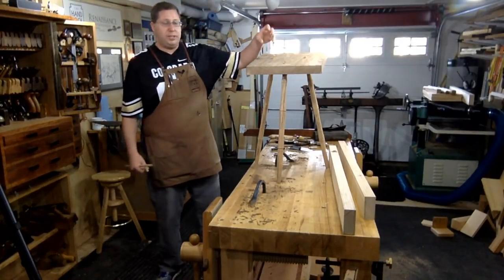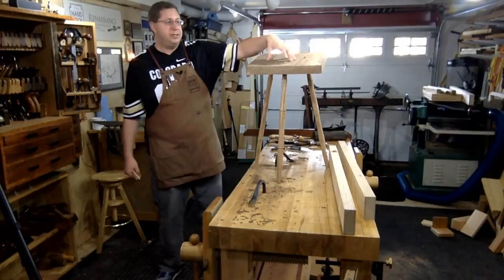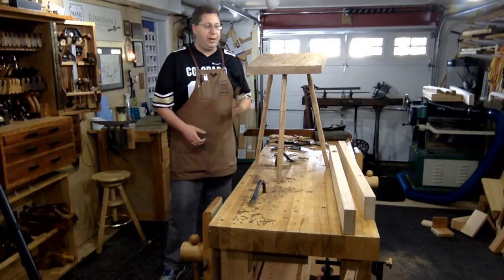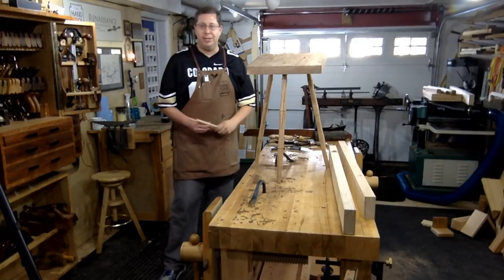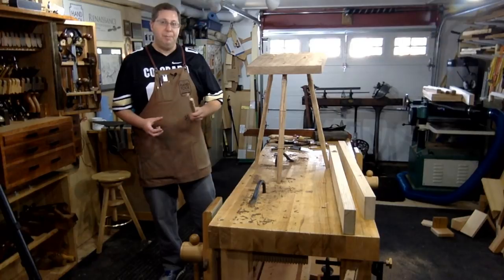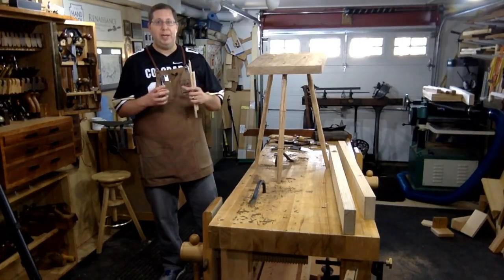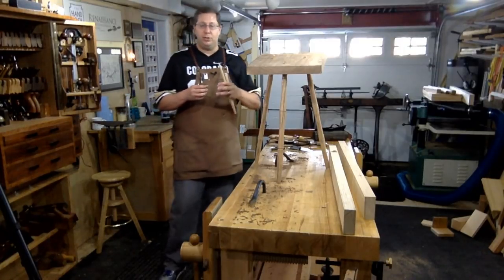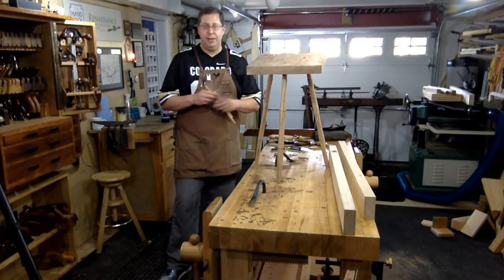The biggest thing is when you actually drive the wedges in later, that you're orienting it to the seat grain so that you don't split the seat grain. You don't have to worry too much about the orientation of tangential and radial planes on the legs, because we're talking about relatively small surfaces. But it's still a good idea to think about expansion and contraction and how those two parts are going to interact and what is going to lock things in the best, so that you don't get a joint that loosens